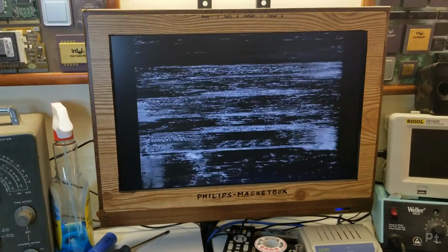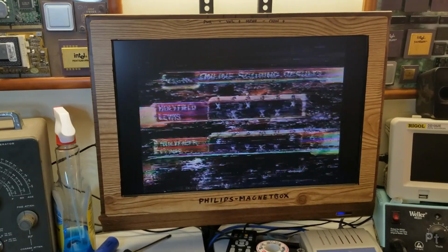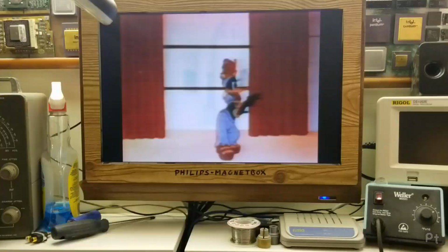Yeah. Further diagnosis is required. Remember Excite? If you ever wanted to know what an EP recording looks like on an SP width head, here you go. You can see all the noisy crosstalk, I believe it's coming from the adjacent tracks. Quite noisy.